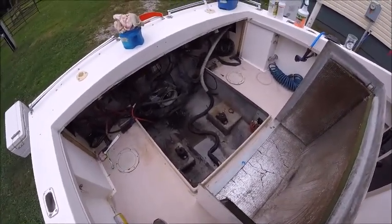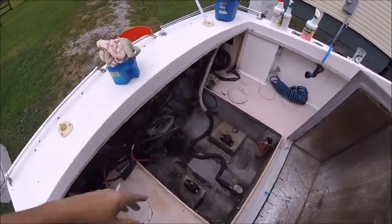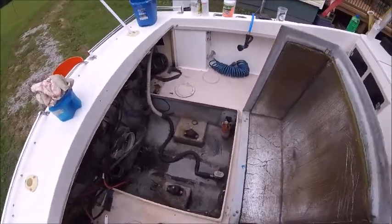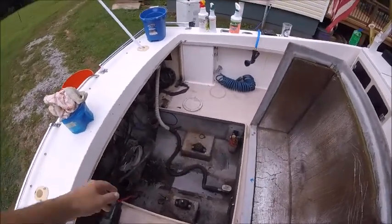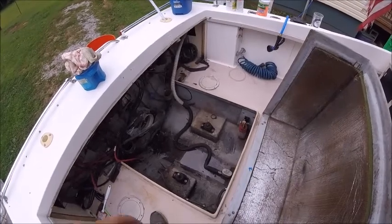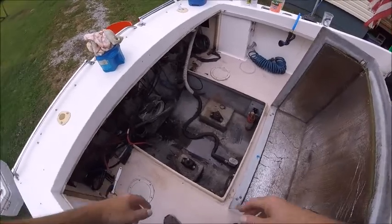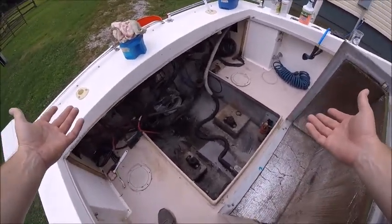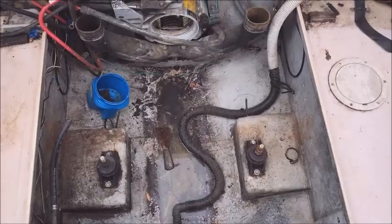As you can see, it looks pretty clean — I've seen them a lot worse. You see all that gunk in the bottom over there, that oil and stuff? This has to be scrubbed completely clean. Maybe put some acetone or some kind of cleaner on it, then paint it with some bilge coat. The new engine is almost ready — it just needs exhaust manifolds and risers. We need to get this part of the boat ready to receive the engine. It don't look that bad, but it's a lot of work, believe me.